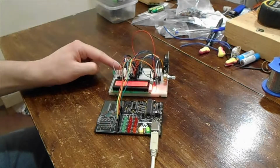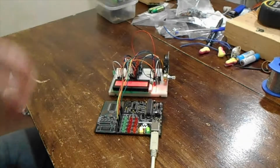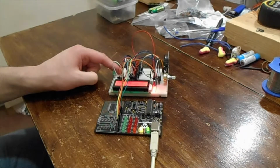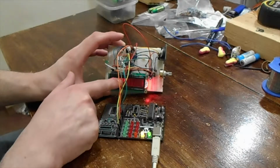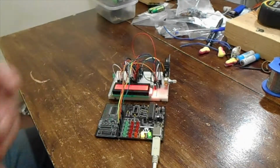Now, it has a massive 25 bytes, that's 25, not kilobytes, just 25 bytes of user RAM. So if I designate RAM locations for certain file registers, so for instance I have one for these 6 values that are alternating on this display, that takes up 25% of the user RAM already.